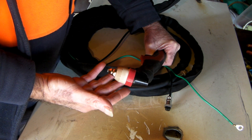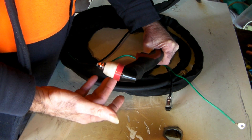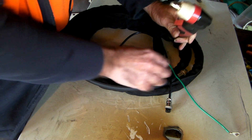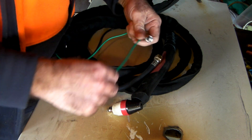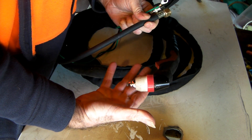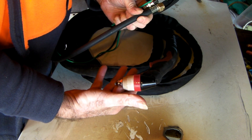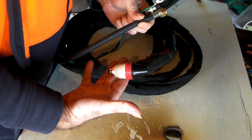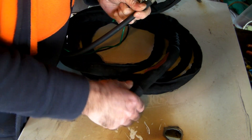So basically a non-touch plasma cutter runs a non-touch plasma cutting torch, which is just a pilot arc torch - which is what I found out. I got all excited about this new model of plasma cutter that didn't exist. I thought you fellas are going to be even more confused than me so I thought I'd do this little video. Basically this is a non-touch pilot arc plasma torch, and now I see they're calling the machines non-touch machines. I don't know why they're doing that, and they're also calling the other ones the ones that you have to touch - touch machines - which seems pretty strange to me.